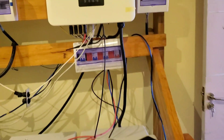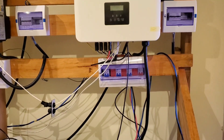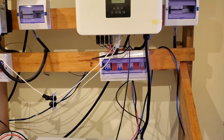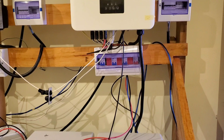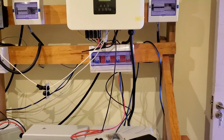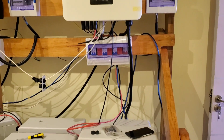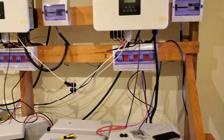What we are doing today is tidying up our cabling. Yesterday we ran the system for three hours. The maximum load we saw was 6.5, so 6.5 times 5 is 32.5 kilowatts on one side. On the other one we're seeing 20, so combined about 55 kilowatts. We currently have 60 kilowatts capacity on each side.